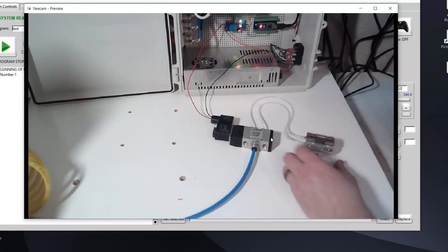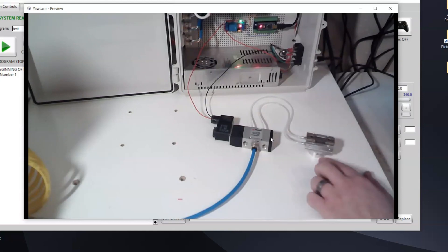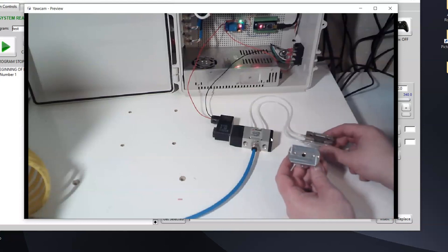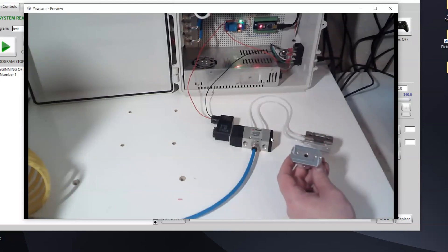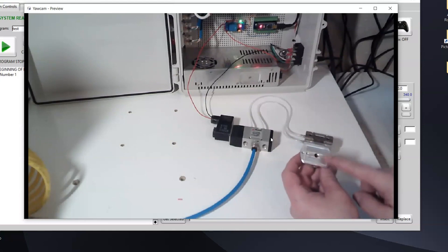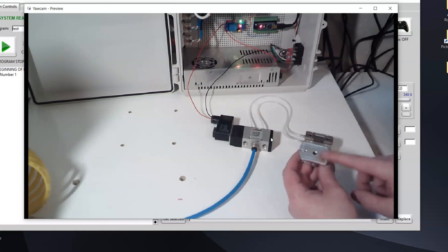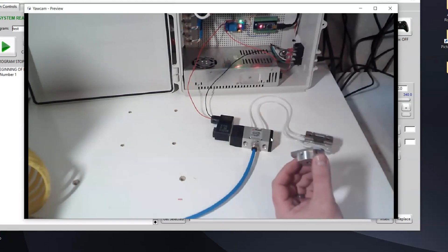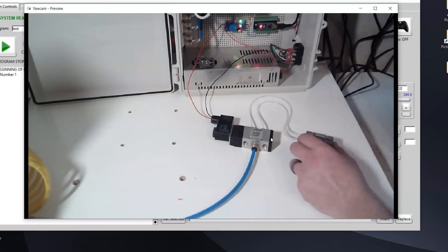This gripper is an SMC gripper. This is the gripper that the robot's joint six tool adapter is designed for — this whole pattern is designed for this SMC gripper. But you can use any pneumatic gripper you want; you can drill and tap new holes, or make a 3D printed adapter. You can put any gripper you want on this pad.